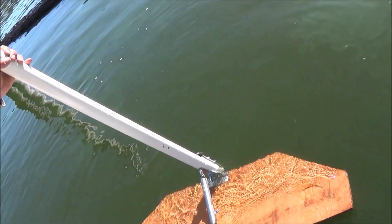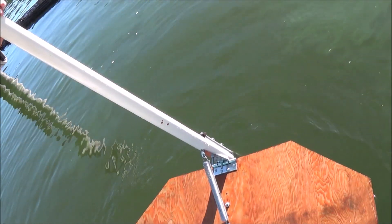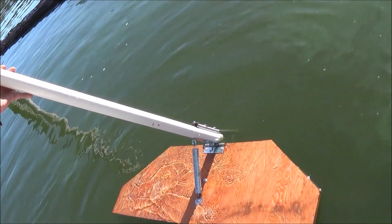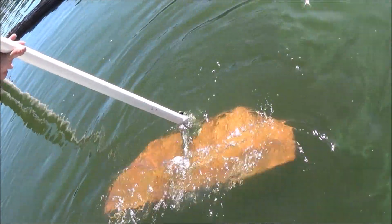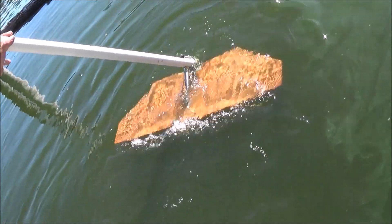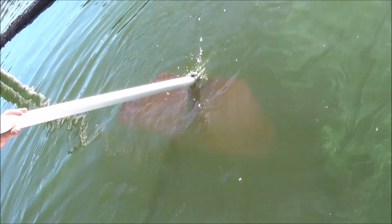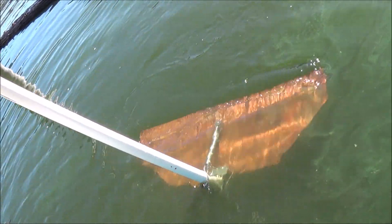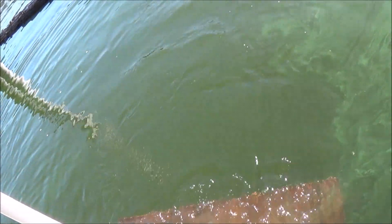To make this design more effective when it comes to generating forward propulsion from a wave, we can now add in that brake design I showed you on the back and forth motion design. It takes a little bit of motion to get the foil to shift its position enough to create the angle we need. Whereas if I lock that down a bit, very small motions would create a lot of forward momentum.